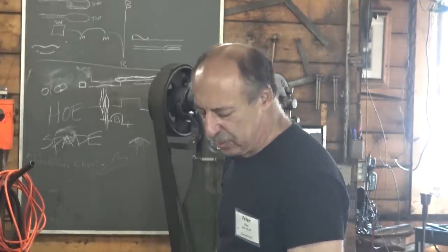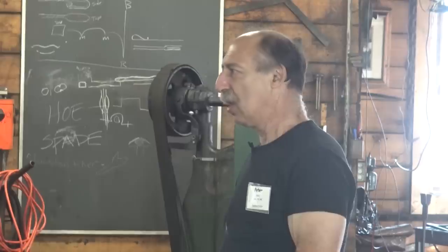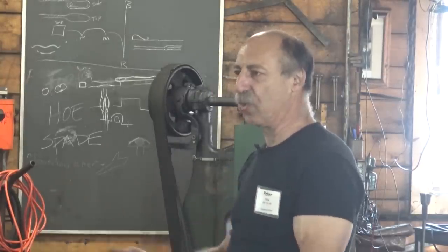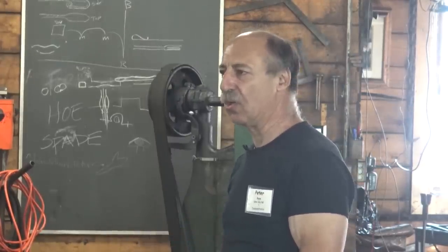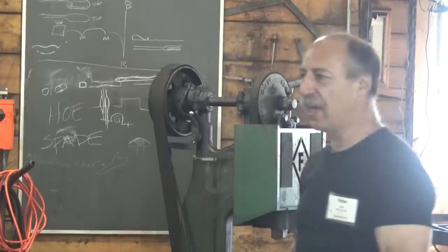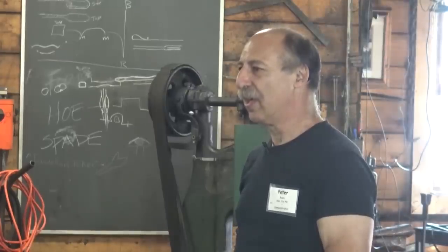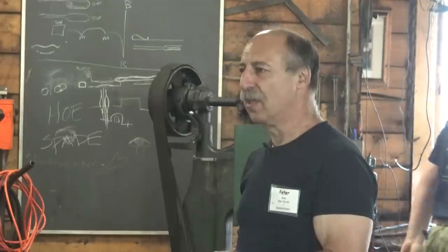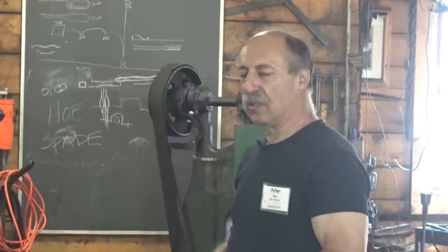There was one common way to make steel: you would make wrought iron bar, and they called it cementation or cementing. You pack these bars in a box within a furnace. Those boxes are stone or iron, and you pack the bars in charcoal, ground up charcoal. You might put 2 tons of bars in one box at a time. Then you put a lid on it, and you heat up the whole box to glowing. You hold it there for several days and let it cool. Carbon in the charcoal gets absorbed into the iron because there's a lack of oxygen in the environment. And so that was sold just as is.